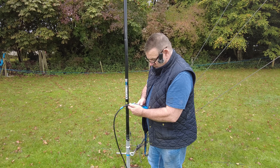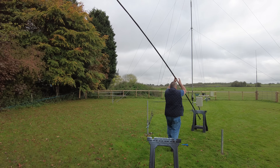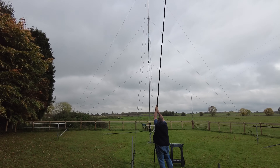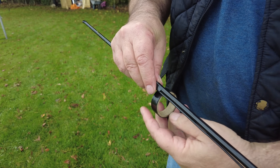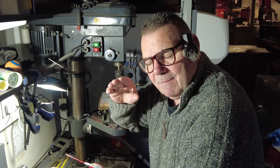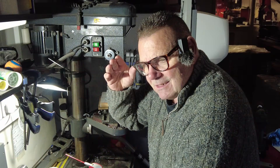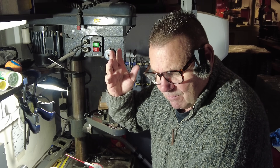For X equals zero, this is currently set at 7.02, which is no good because we're looking for 7.175. However, on a four square you have to tune a few percent below, so actually aiming at 7.07. That's about a four or five hour job — taking every vertical down, tuning it, I'm talking a quarter to half an inch, 12.5 millimeters. You can't quite tell on an SWR curve where the reactance is best, so ignore SWR and go down the reactance route.